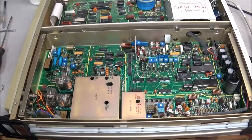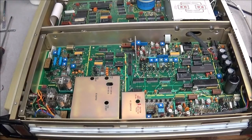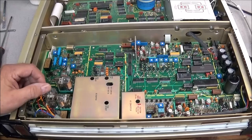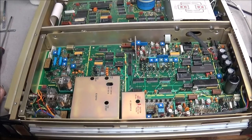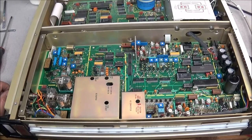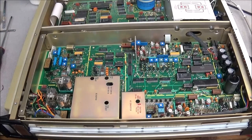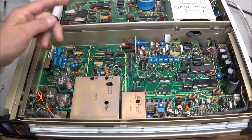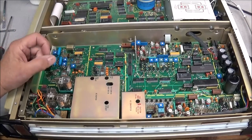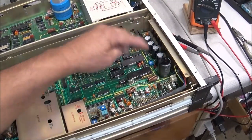I've got our new resistors replaced on the DC logic board. But wait — that resistor R255 suffered a major failure. Resistors just don't burst into flames and burn up for no reason. So there's got to be something going on. Either something on the output side is shorted and causing it, or there's a problem in the voltage rail. So what we need to do is go back and check our voltage rails.